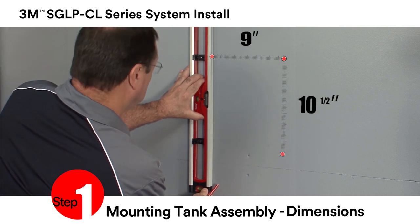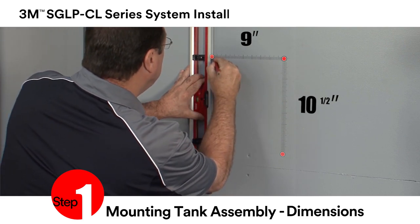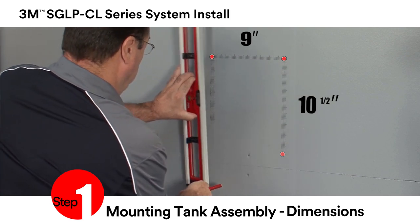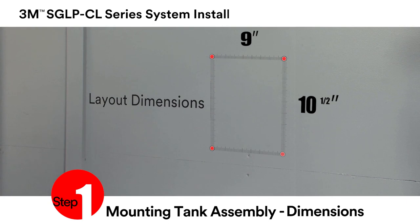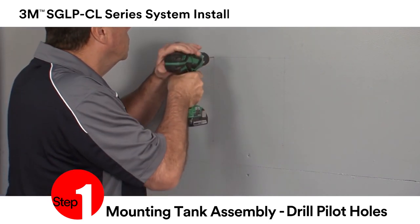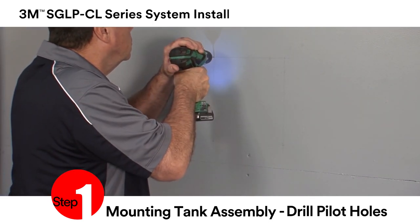Make a mark on each of the vertical lines 10.5 inches down from the original marks. You should now have 4 marks indicating the mounting hole locations. Drill holes at each mark as appropriate for the mounting hardware being used.